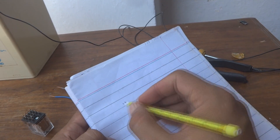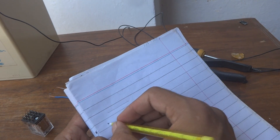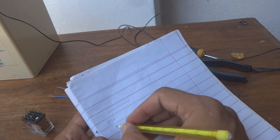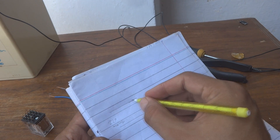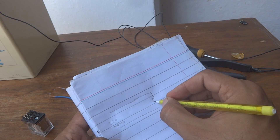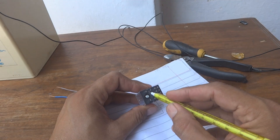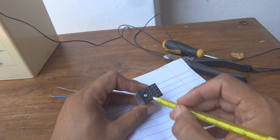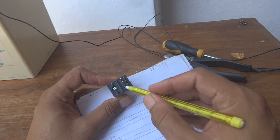Let me explain the circuit diagram. The 220 volt mains — phase and neutral — will come to the relay coil. These two terminals are the coil terminals. There is no connection of these 220 volt mains to the contacts — keep this in mind, especially new people.